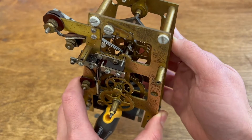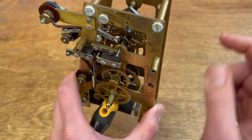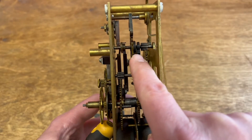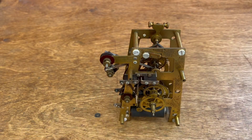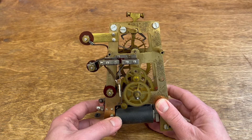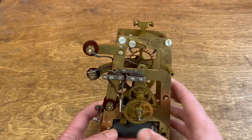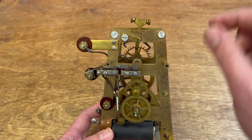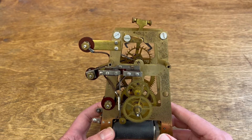You can see the pin right here. If I let the clock run, there's the pin on the left side of the escape wheel. And on the back is this contact right here, which makes contact with this terminal. So the principle is roughly the same. The difference is this clock provides power to the terminals for a longer period of time. My clock provides a one-second pulse based on the contacts coming in and out with the motion of the verge and the smaller size of the contacts on the wheels. This one seems to make contact for about eight to ten seconds.